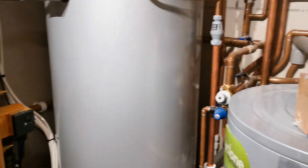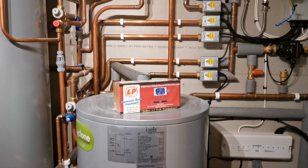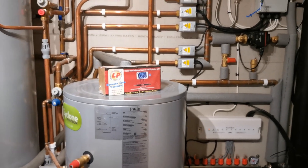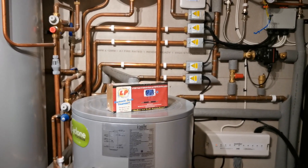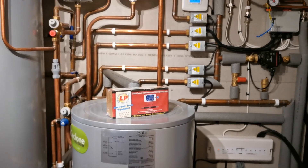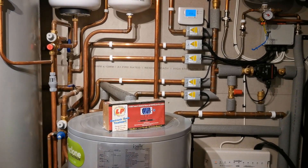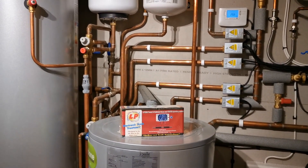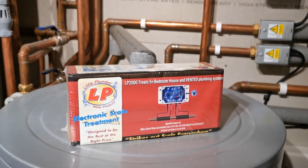The reason we're going for this design is twofold: one, the tightness of this cupboard and not wanting to bring salt in either cartridge or traditional bag form because it's so messy; but also because this water supply has to be multifunctional — it's got to feed the boiler, which we want softened water into, and also be drinkable, feeding both cold and hot supplies. We're looking at something that'll significantly reduce scale build-up because our water is very hard.